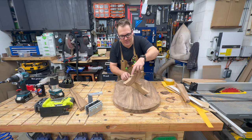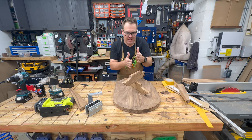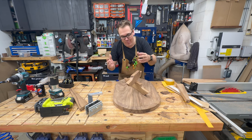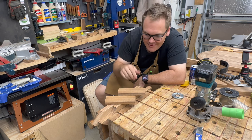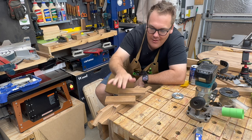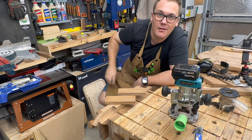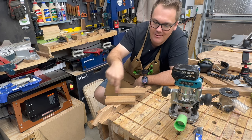What I'm doing now is just trying to work out what the angle in relation to each other is going to be. I don't want too narrow and I don't want too wide — I'm just trying to eyeball it. I've got my two top leg pieces in here, the angle set, and two guide blocks double-sided taped down. I've got a guide bushing flush trim bit in the trim router and I'm going to hog away the waste.